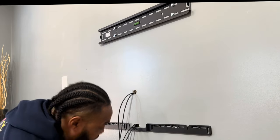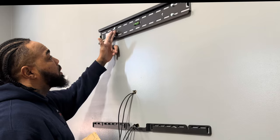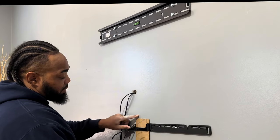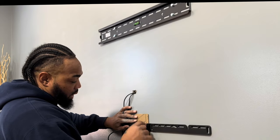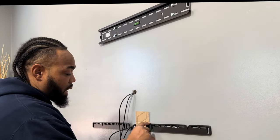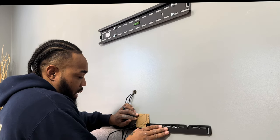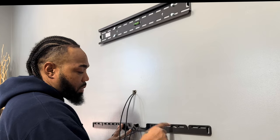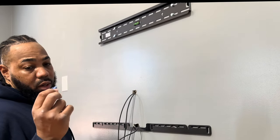So earlier I was showing you how this template works. I would have this in my hand before I screw it down. I screwed it onto two studs — I already had my TV bracket up, so I knew the studs are here and here. So that's how the template goes: you find where the bottom of the TV is going to be at, then you take this template — it has numbers on it, like one, two, three. You put it here and at the top, that's where the top is going to end up at. I wanted it at two inches, so I held this at the wall at two inches, put my level on it, made sure it was level, drew my little line in, pre-drilled the hole, and then put the screws in. They come with little anchors if you can't find a stud. You have to do pilot holes to fit them in — it'll tell you what size hole. But I went straight into studs.